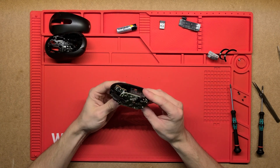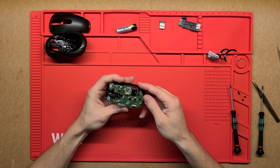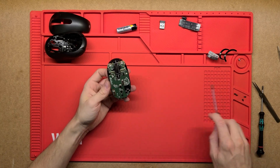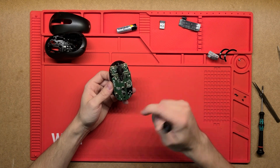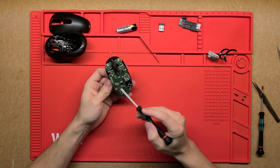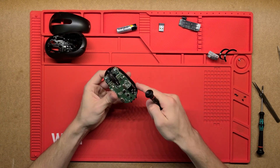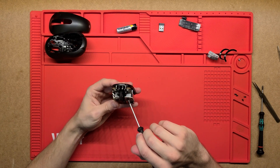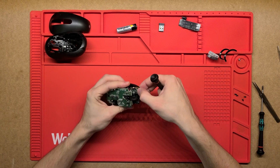So we've got the actual boards inside the mouse. It's got a couple of crystal oscillators there that would be determining frequency — this one here is probably for transmissions, and there's an antenna just there, that exposed copper channel. That would determine the frequency to transmit at that the USB receiver would then receive. There's a little controller and then two bottom PCBs with tactile buttons for left and right button press.